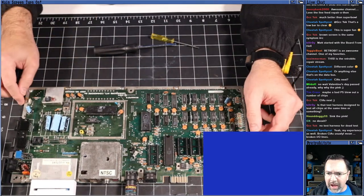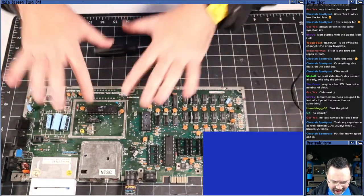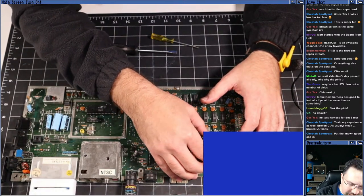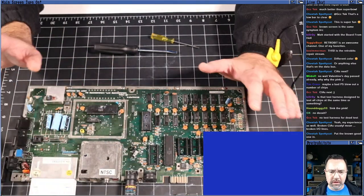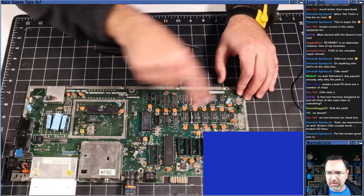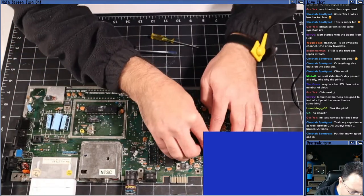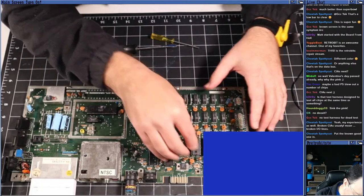Okay. Yeah, I do have a full harness, and we can use that once we get past identifying what chips are keeping it from booting, because the machine won't boot into a state. Remember that the diagnostic cartridge doesn't use Ultimax mode because it needs access to all of the RAM. So the diagnostic cartridge is a regular 8 kilobyte Commodore 64 cartridge that loads into the high cartridge bank.